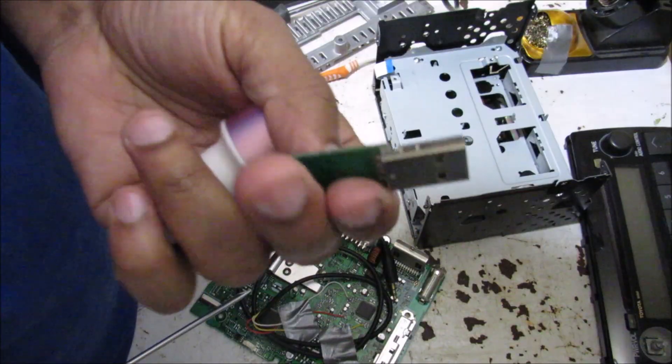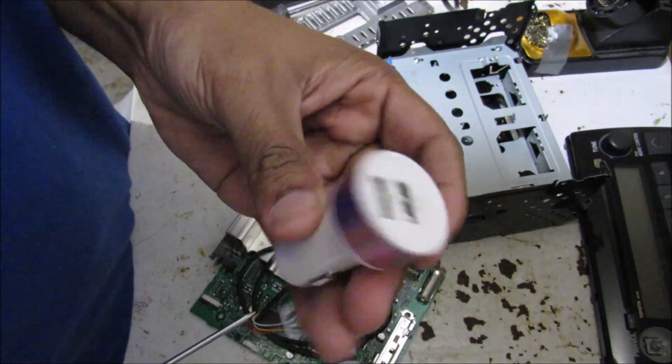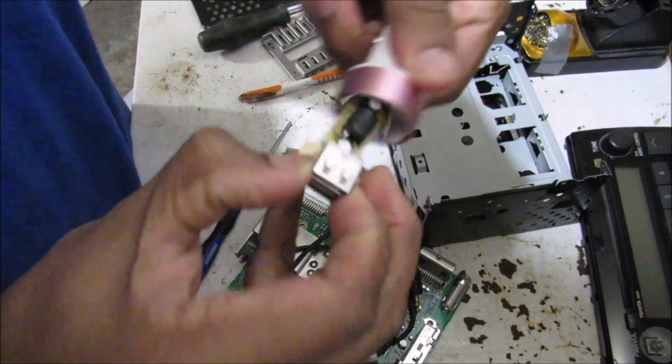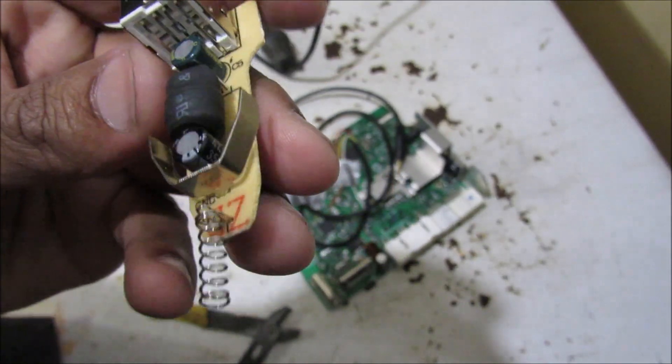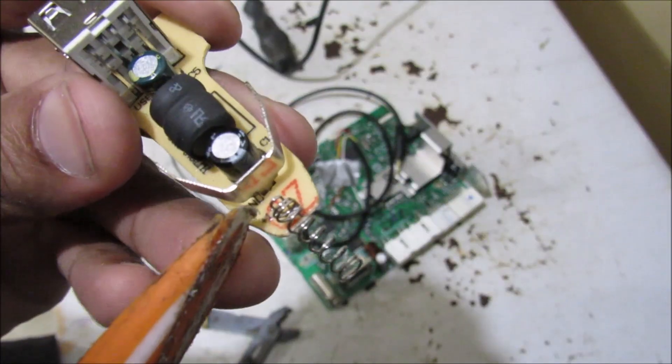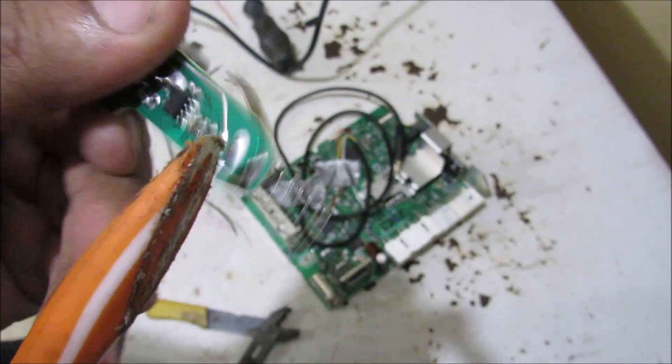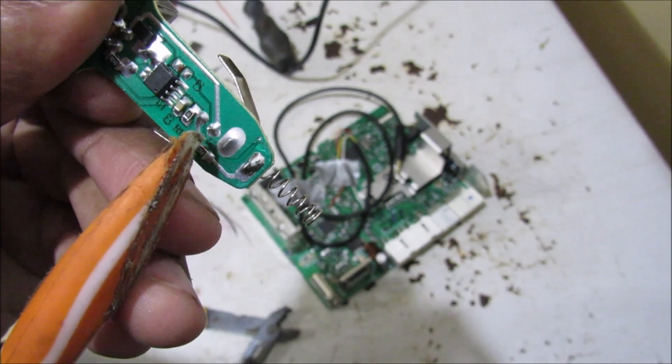Normally these come with a case, so the next step is to remove that. We're going to take the case off the power inverter and remove the circuit board. Here's a detailed look at the power adapter: you've got your 12 volts connecting to one port and the ground port. I'm going to solder to the respective positive and ground points.